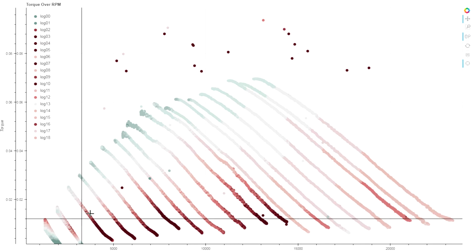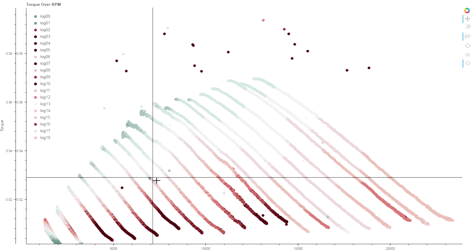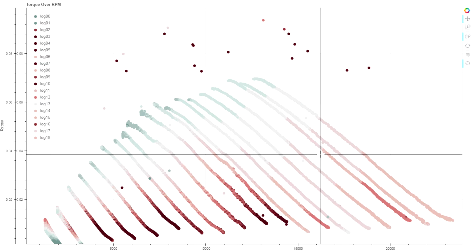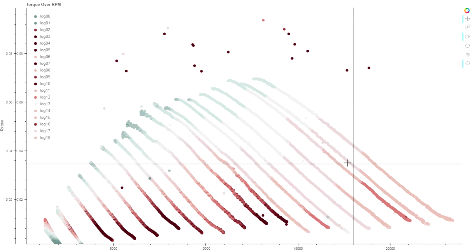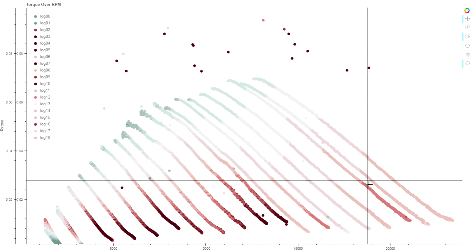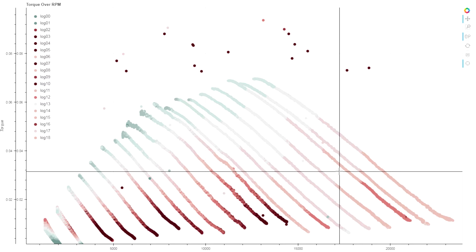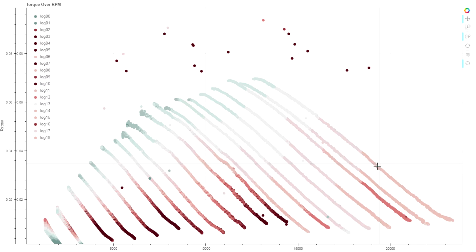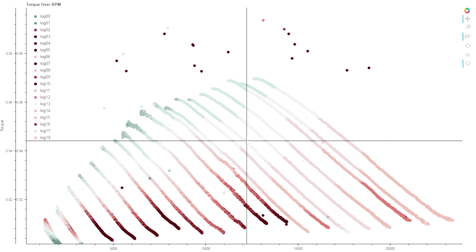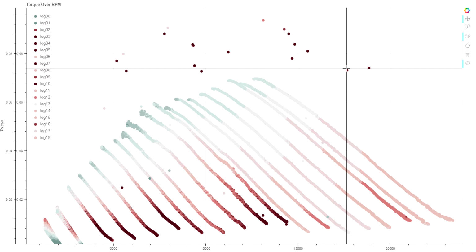You'll notice down low that every single throttle value is giving us a fairly evenly spaced amount of torque. And then the difference between 95% and 90% throttle is very close. So as we go from 80 to 95, we're getting a big jump of power, and then it's hitting a flat spot and jumping up again to 100%. Except that's totally wrong. All of this is bad data, despite the calibration of the load cell being totally fine and the test weight measuring correctly.